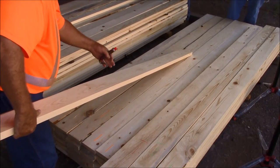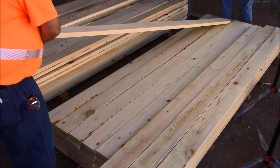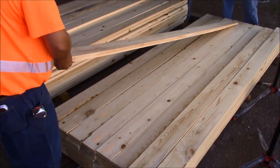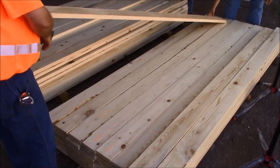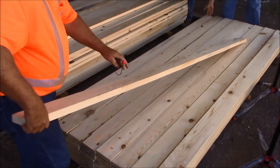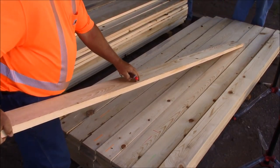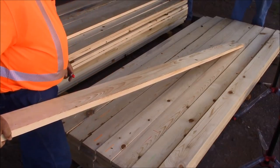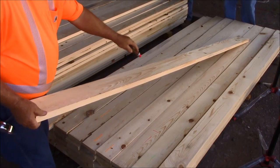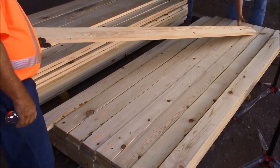Here's a small blemish on nice finger joint material — it's really barely perceptible, so these are 3 shop finger joints. Same here — 3 shop finger joint. Here we've got some pineapple damage down the side — it's a feeding mechanism for the lumber through the planer, it makes a mark down the edge. It's too deep to consider as part of the cutting, so we've got to cut around that and take the clear portion out for sash cutting. We'll get a piece of 3 shop.